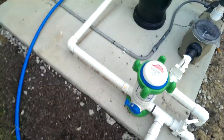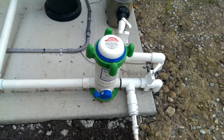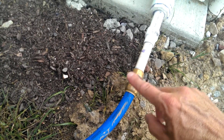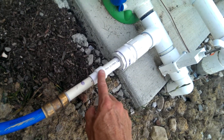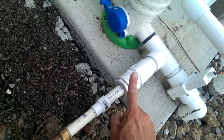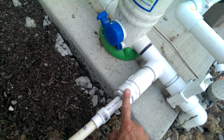We come back into the pool after the filter, so the filter water is still going. This line is going to meet up with the filter water. It's PEX three-quarter inch, SharkBite three-quarter inch CPVC, then CPVC to PVC exchange — three-quarter inch PVC to three-quarter inch PVC — then a three-quarter inch to inch-and-a-half PVC reducer, back to the pool.